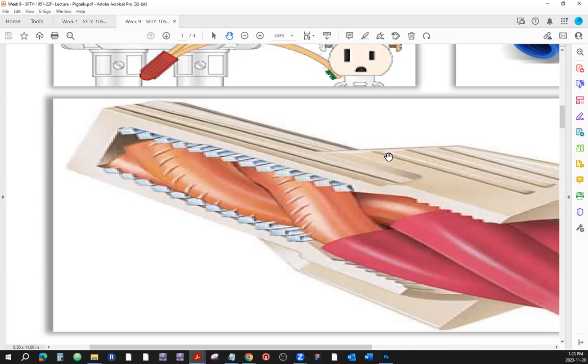So in this case, clockwise would be, if you flip it around, this way here. This way would go and tighten. This wire nut would be tightening this way here. The wires inside are pre-twisted the opposite way. See, the wire nut will turn this way, and the wires are pre-twisted the other way. Okay? I left it on purpose.